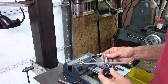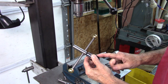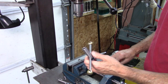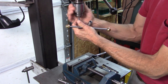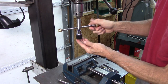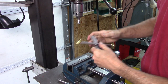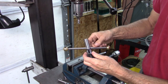Before we move on to the types of taps, let me show you this. I made a video on this — I'll put the link in the description. You can leave the chamfering bit in the chuck and use the bed itself as a guide. It provides a lot more leverage, holds the tap securely. It's a driver that I made a handle for.